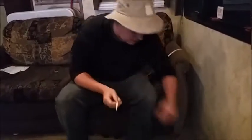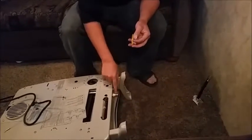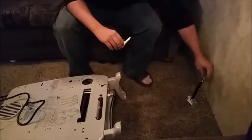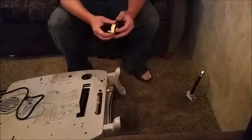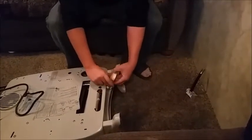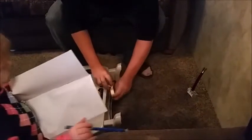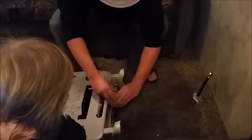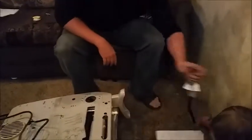We've got the line to the floor now, as you can see here. The last thing we're gonna do is hook our compression fitting up. The reason we wait to do this at the end is that this fitting turns and will attach without turning everything else, so you've gotta do it in proper order. We're gonna go ahead and wrap this thing up again with a nice heavy coating of Teflon tape to keep it from leaking, and then it's just a simple matter of screwing the two of them together.